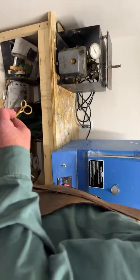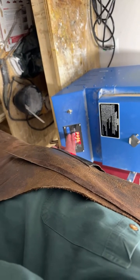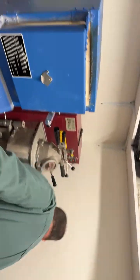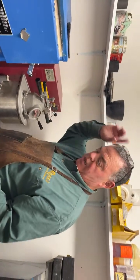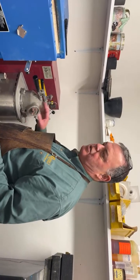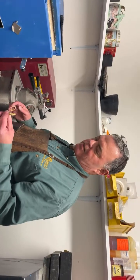And I just hit abort. Shut the vacuum off. Now I shut the casting machine off, but there is nitrogen that we introduce into the system so that it's an oxygen-free zone. Why you do that is because it gets so hot, all the equipment, the tools, everything would burn up. So when you put nitrogen, and we have a nitrogen tank attached to this, and when the nitrogen goes in, it actually keeps the equipment from burning up so quickly. Think of the shuttle coming back into space, right? Coming back into the atmosphere.